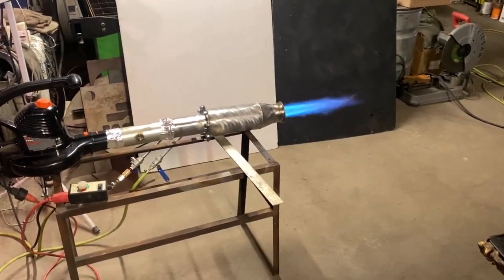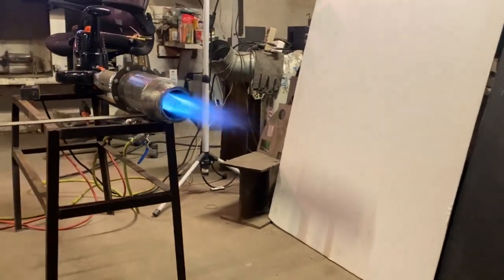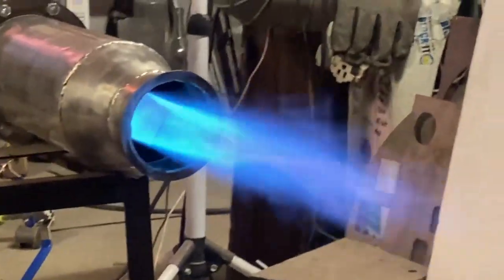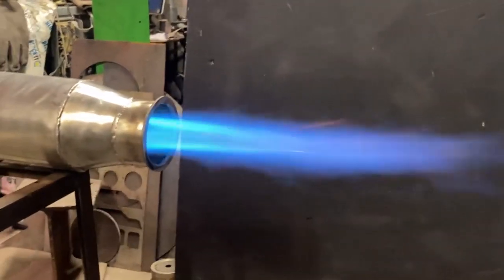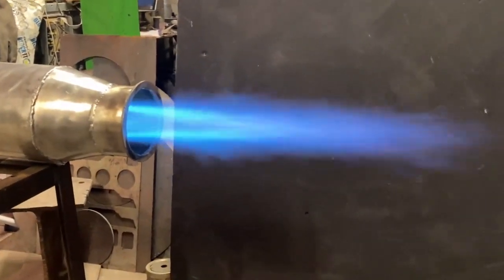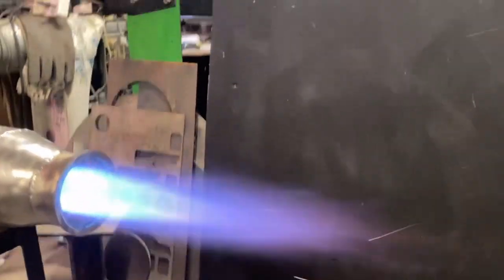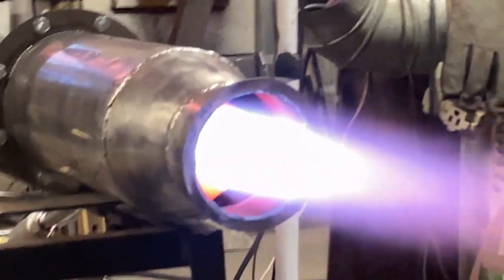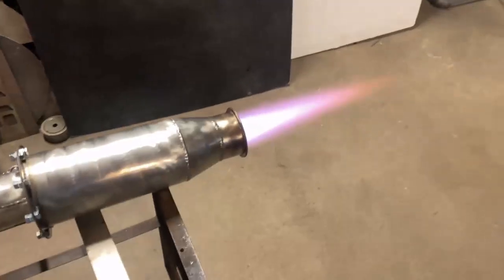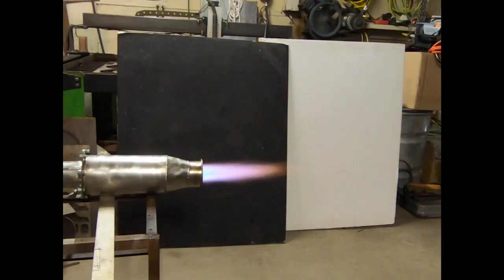That's with no air compressor, and it's actually looking really good — a beautiful-looking flame. It's doing really well. It's running so well on propane that I know we're not going to have hardly any problems on the waste oil. This thing is doing phenomenal, running like an extremely powerful high-velocity burner with a dual-air setup. Now, as far as I can touch the can — past that point it's 130 degrees — which means we are getting some pretty good preheating.